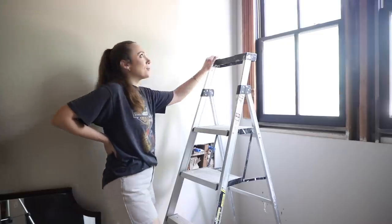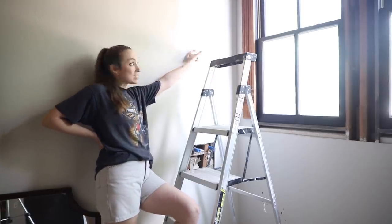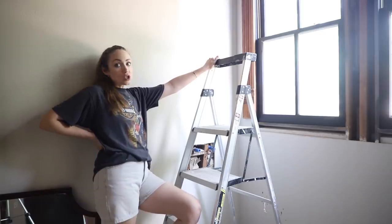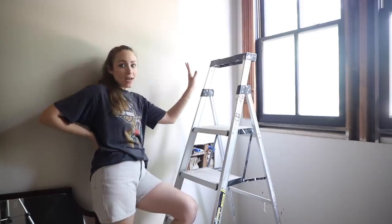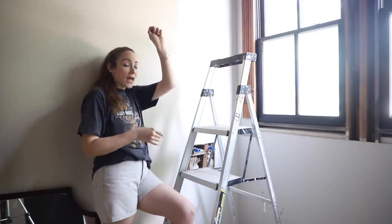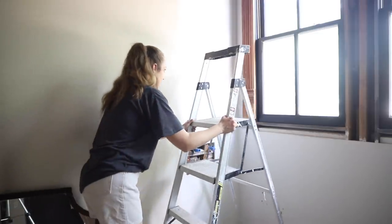I might be changing course. I'm thinking it's going to be really hard to get the grout into the skinnier areas around the window trim. Instead of actually installing it, maybe put it up there and trace a line, then bring the tile to that line so the trim isn't in the way. Then put the trim up and caulk a seam in between the two. I'm all about it being easier to tile for sure.